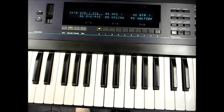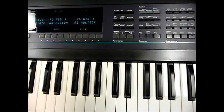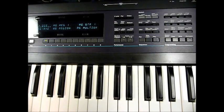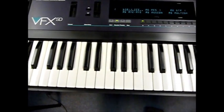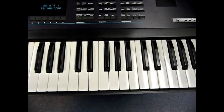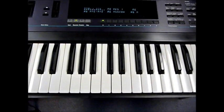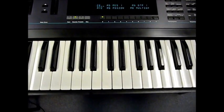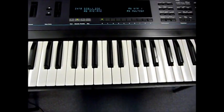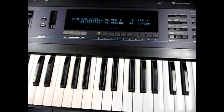There's a couple of problems that these keyboards are renowned for. One is the low battery sign. I believe it's a hardwired battery which you can replace quite easily. So it says on YouTube if you look at the how-to videos. And the other issue was the keyboard strips which run underneath the keyboard. There were 2. One for the right, one for the left, and they were connected in the middle, and that connector got pressed down on a lot because this machine has polyphonic aftertouch. So pressing down a lot on those keys actually loosened the connector between the 2 strips, and that would mess up the keyboard calibration. Again, there's a how-to video on YouTube telling you how to repair that.